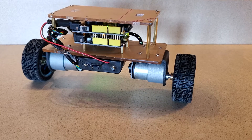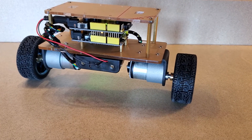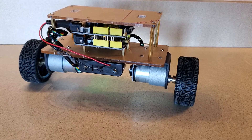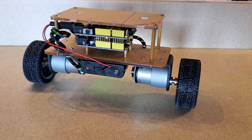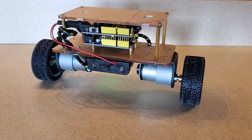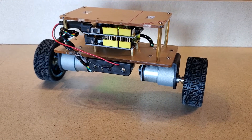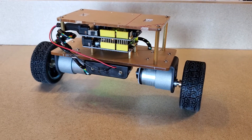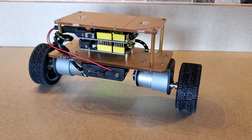The speed and direction of each wheel adjusts automatically to account for the difference in the tilt angle of the robot. When the robot is just about to fall forward, the wheels go forward, and when it's just about to fall over backwards due to gravity, the wheels turn backwards. It makes continual adjustments to make sure that the tilt angle is around zero.